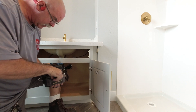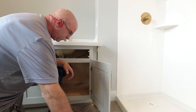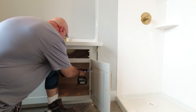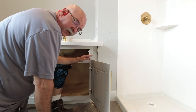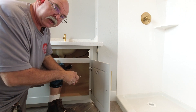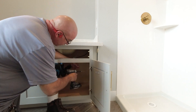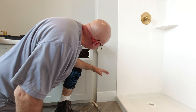Pull a screw out of the bag — hope I have one that's the right size. We'll have to drill the hole a little deeper as well. Using the longer screw in this case is not a bad thing — we have plenty of room for the screw. The bigger the screw, the more rigid it will be. And because we're working on the lightweight particle board side on this particular cabinet, we'll put a little reinforcing washer — beauty ring, whatever you might want to call it — on there. Go up inside there. First one, and now that anchors it in place so it's not going to fall down.